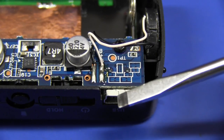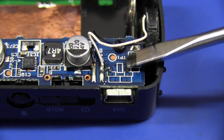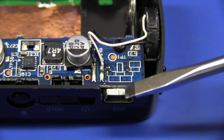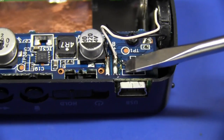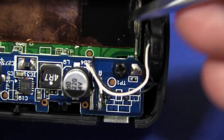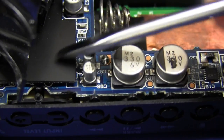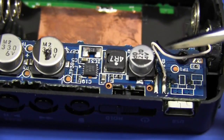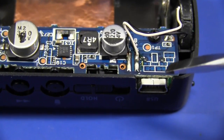Now this is rather curious - they've got the USB Mini-B connector soldered onto the DC-DC converter board up the top here. That's quite strange because you'd have to get the data connections off this board. So presumably there's either a ribbon cable under the bottom connecting down to the bottom board where the processor is, or the data connections go through the DC-DC converter board somewhere. That's just a rather unusual placement for the USB connector.